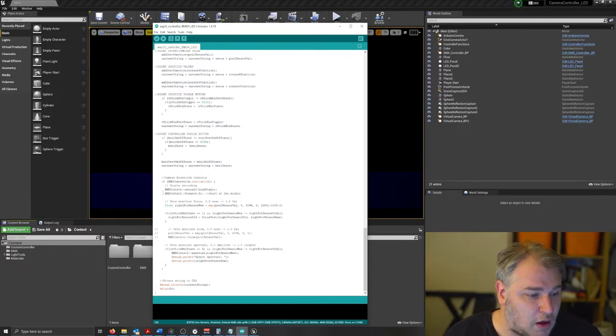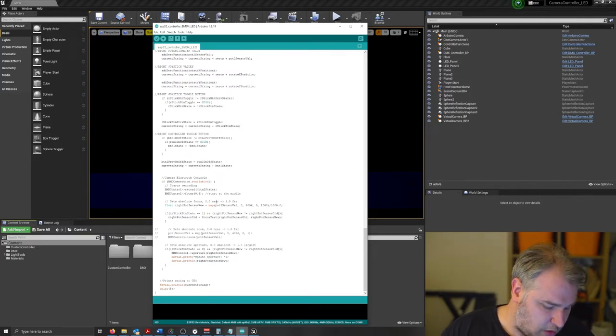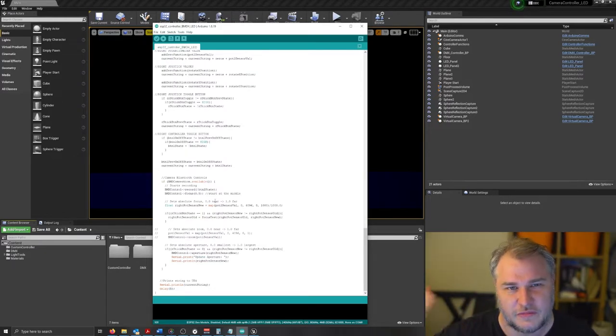The Blackmagic control focus starts at 0.5, so it automatically snaps to the central point as a start point, and then from there we can use a few different things. So we're mapping the sensors. With the new version of the ESP32, instead of the values going up to 1024, it's a higher bit, so we get a range of up to 4096 now. So we remap that to 1000 because that will essentially be remapped right back down to a range of 0 to 1. By going to 1000, we get the decimal point. If we don't have the decimal point, we get it cut off.